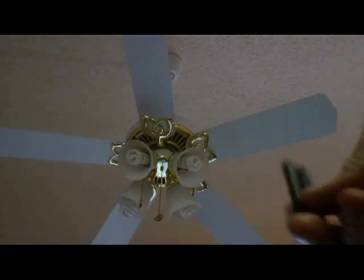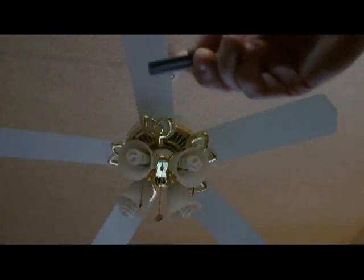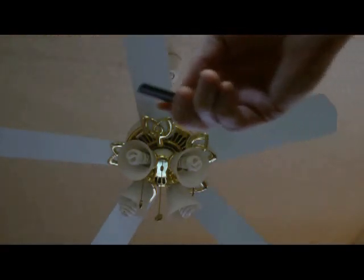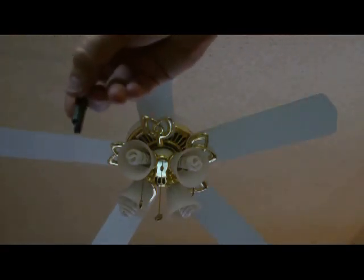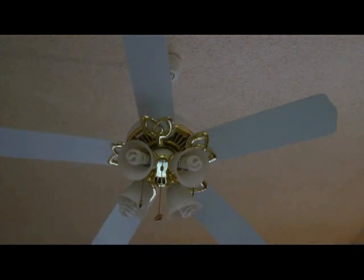Then you turn the fan on and see if it wobbles more or less at that point. And then you do that for each of the fan blades. It takes a long time because you gotta let the fan blades stop and all that so no one gets hurt. But you try it on each one of the fan blades. Whichever one gives you the least amount of wobble, that's the one that you're gonna leave your clip on,